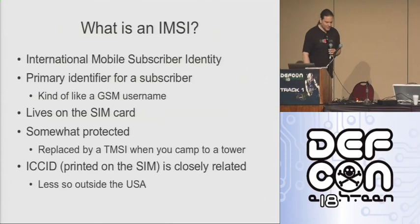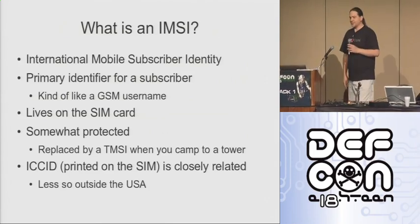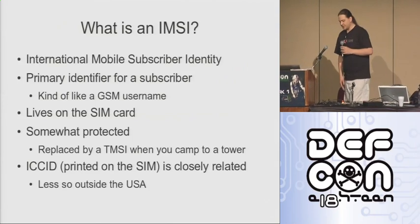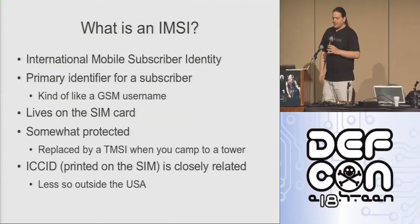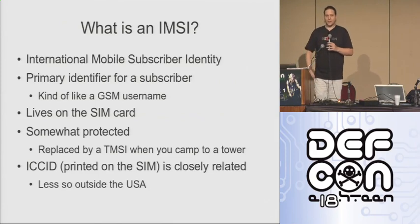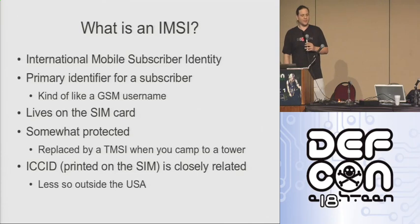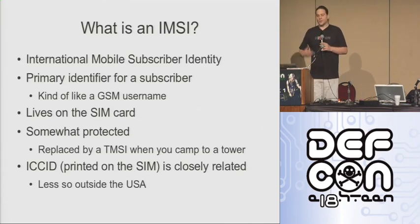Okay, so the whole idea of the talk is, I'm talking about IMSI catchers, but in order to know what an IMSI catcher is, you need to know what an IMSI is. An IMSI is an International Mobile Subscriber Identity. You can think of it kind of like a GSM username. It's one of two parts, the two things that live in your SIM card that authenticate you. Your IMSI is like your username. KI is the secret key that authenticates you into the network.